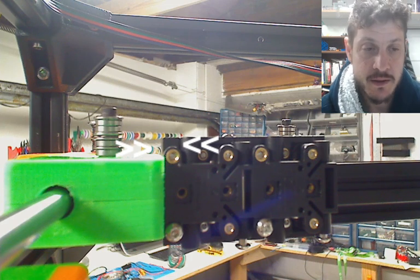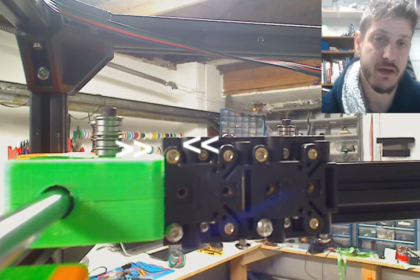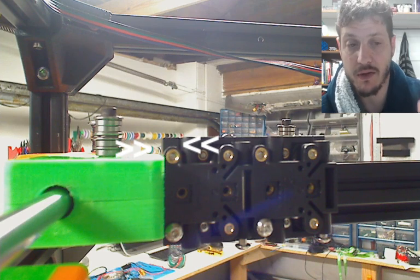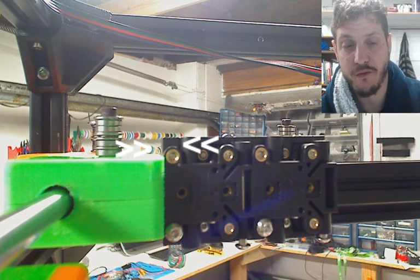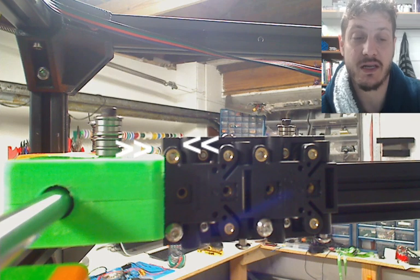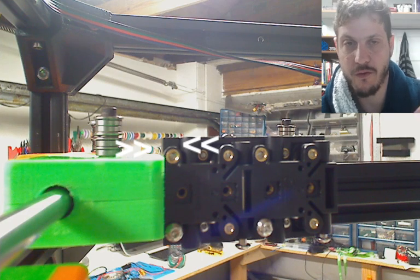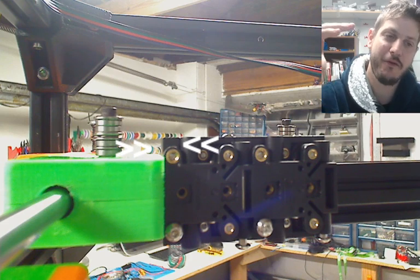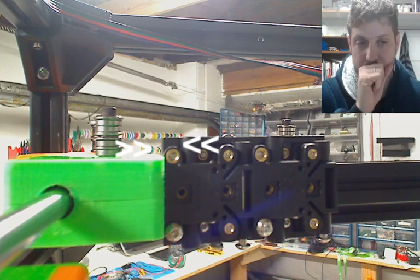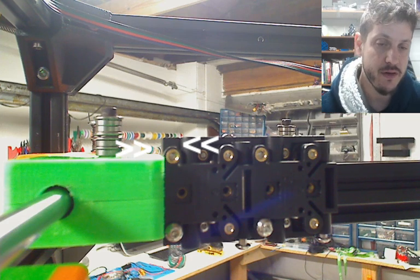This mismatch can play out two ways. The option I'm going with is raising the stepper motor and the belts in the front by 14 millimeters — 9mm for the exoslide itself plus an extra 5mm needed for the belt bracket on top. So you raise the whole platform: the green X-end part, the orange part behind it, and the motor ends — raise them all by 14 millimeters — and now everything is level again.